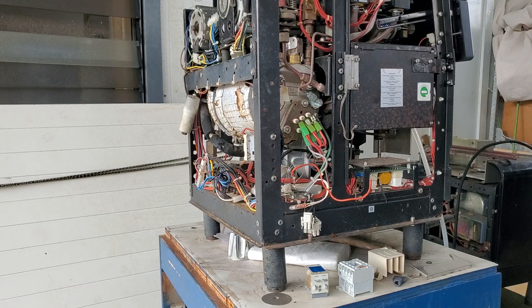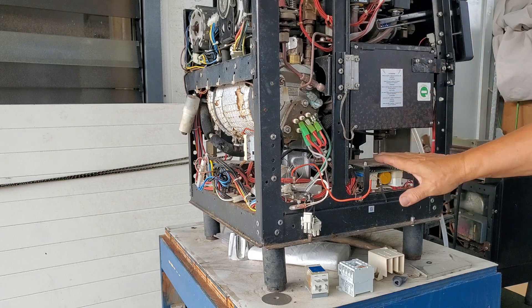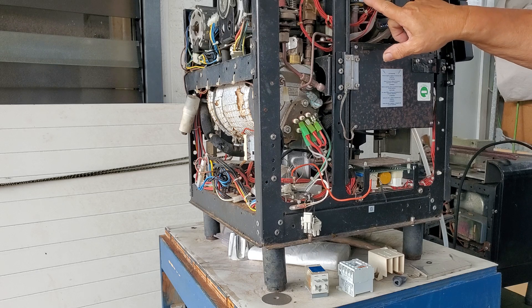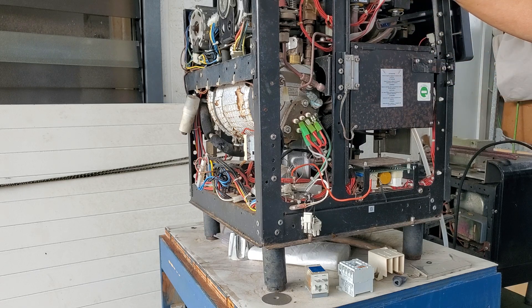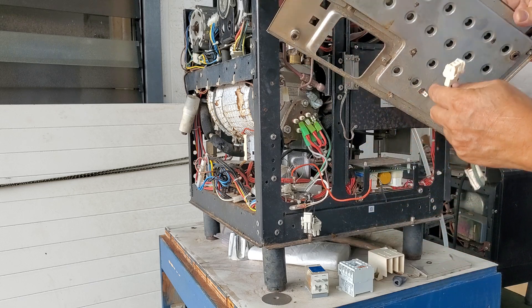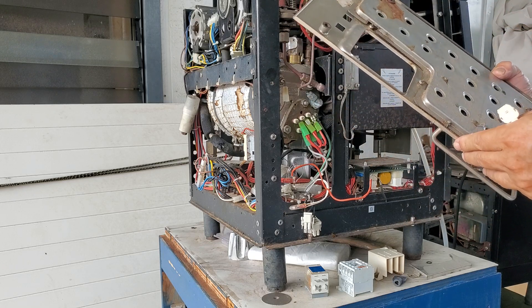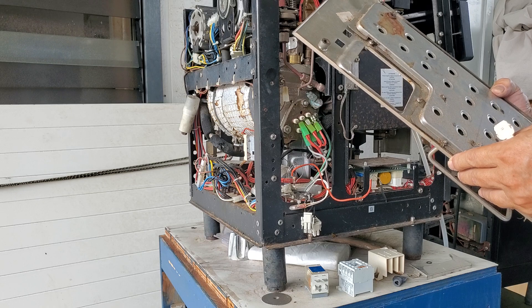Other than that, the rest of the power goes to the computer which controls the various valves — it's a 24-volt system, and all the valve coils are labeled 24 volts. The other place power goes is to the cup heaters on top, depending on whether it's plugged in, and if I'm not mistaken that's also 24 volts rather than 220.